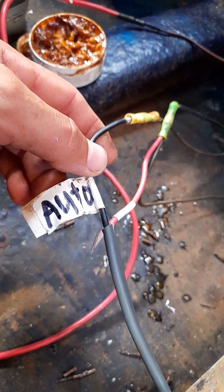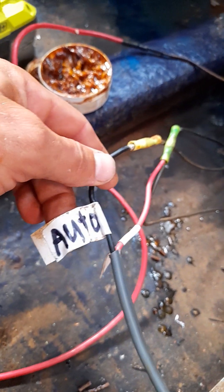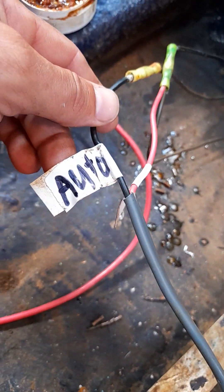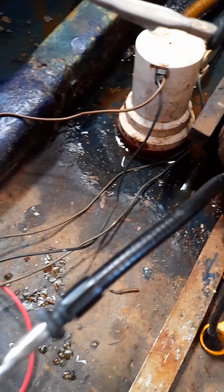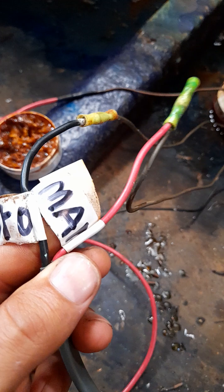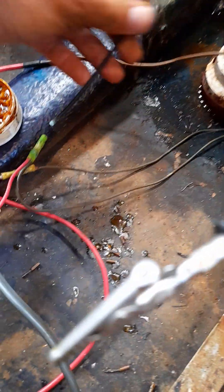So the automatic makes sense — there's intuition here. The automatic is going to be the one that's always left on, so that's only triggered by when the float switch is triggered. You take the automatic negative and wire it to the switch, then come back into the main negative. And then the manual is only going to be intermittent, so the manual goes straight to the pump — straight into the negative line.